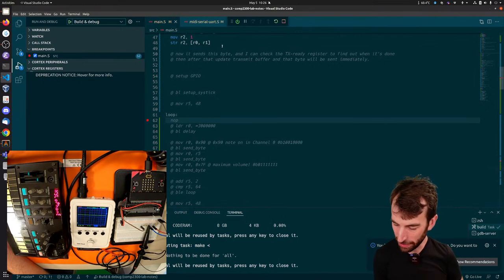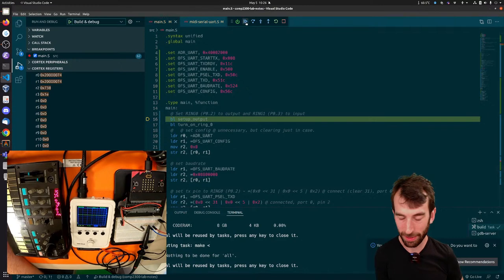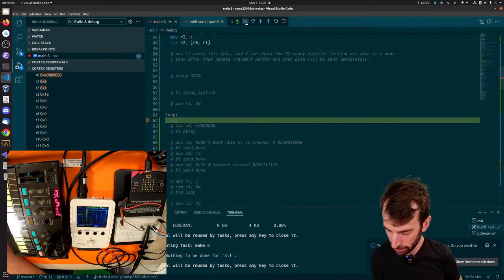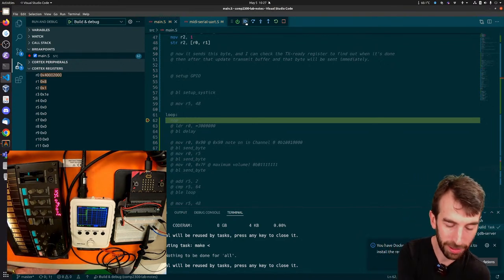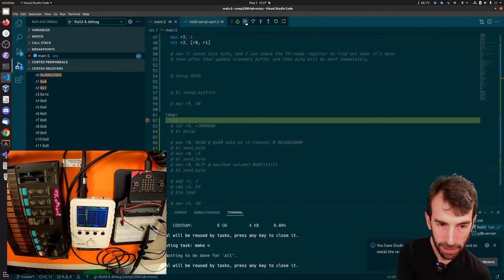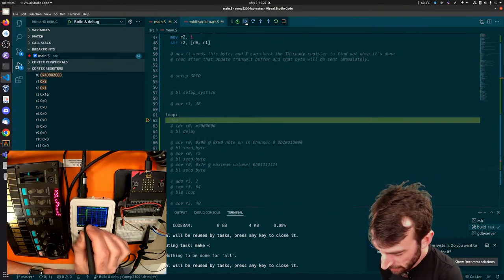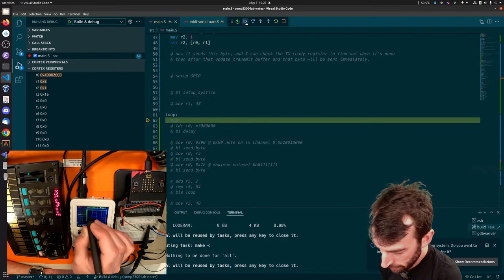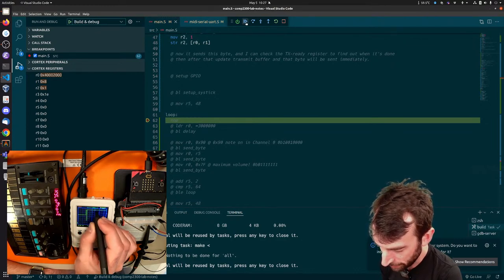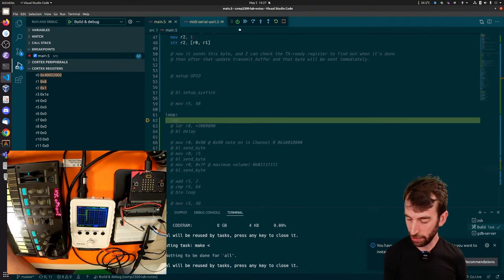I sometimes have a little bit of trouble getting my nice little demos to actually work if I'm just clicking through them. Okay, there's my first byte. This one's pretty easy. It's just got a start bit, which is zero. This is everything getting ready, high. Then there's my start bit, and then there's the FFFFFF, and then the stop bit, and then it stays high at the end. So far, so good.